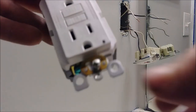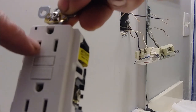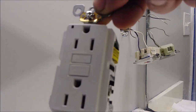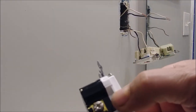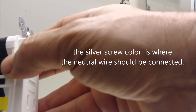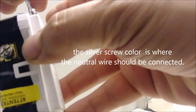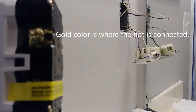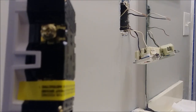So that's the way — if you flip it the other direction, this side becomes the hot and the other becomes the neutral. It's very important to follow this. You can also see the color of the screws: the silver screw is for the neutral, and the gold screw is for the hot. So gold equals hot, silver equals neutral — just to make sure you won't be confused.